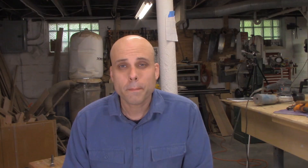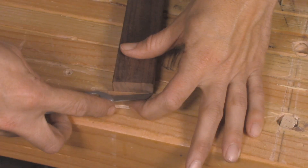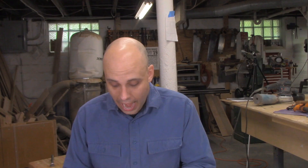To build our squares, we're just going to use all the regular Woodwork for Humans tools we've been using up to now — there's a list of everything down in the description. But for this project, because we're going to be doing more precise marking and measuring, we're going to want to ditch the pencil and switch over to a marking knife. Knife lines are more precise, and because you're actually making a cut into the wood, they can help to guide other tools. It's really the preferred way to do your layout for woodworking.